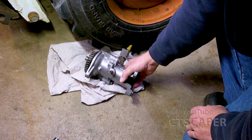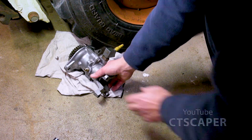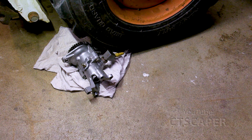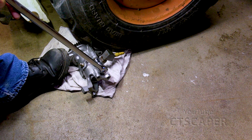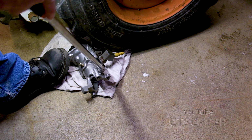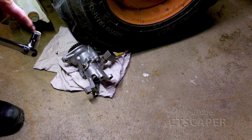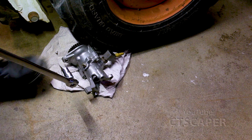but I gotta wonder, see, you got this fitting here. It seemed to work better getting it under the tire because it wanted to slip out. I'm not sure if it would come off this way, but I didn't want to just start banging on it because I believe it's aluminum, and I didn't want to crack it. So I'd recommend using a 6-point. I only have a 12-point, unfortunately. That seemed to be the best way to get these free without killing yourself.